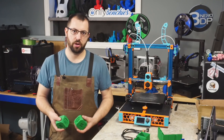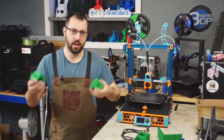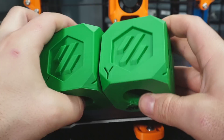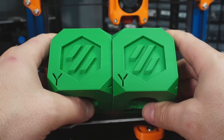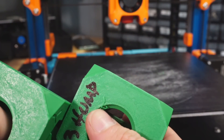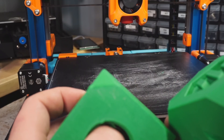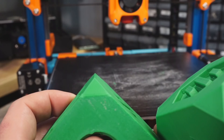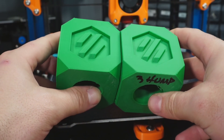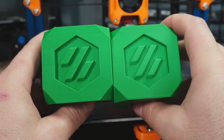When you compare the two prints they are relatively close in quality. Remember you have to redo your pressure advance tuning any time you adjust input shaper values. The cube with the recommended three-hump EI settings does have a little bit less ringing, however the corners are not quite as crisp versus the cube with MZV settings — that is one of the big differences with the more aggressive input shapers, they tend to round the edges of sharp objects. So I recommend going with MZV: you'll get a noticeable improvement versus no input shaper, and then if you want to improve quality further, start trying the more aggressive input shapers.